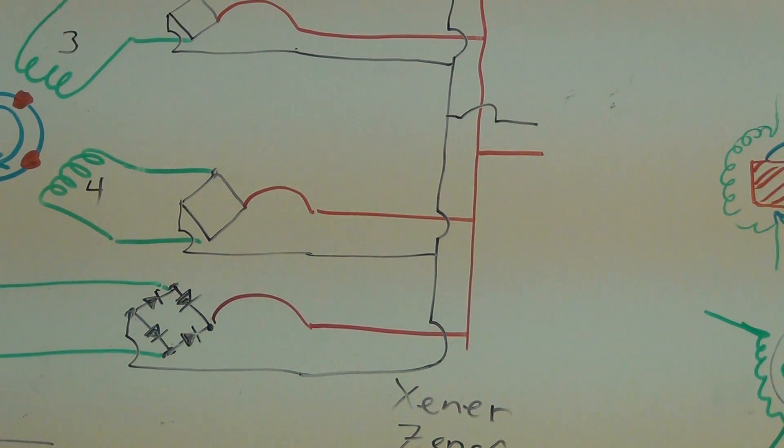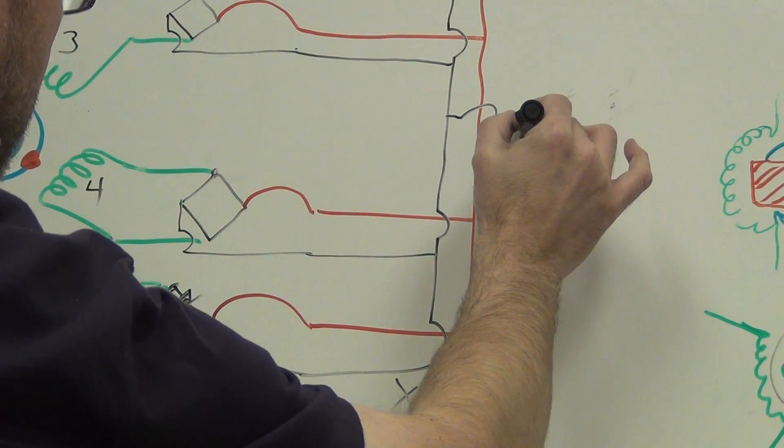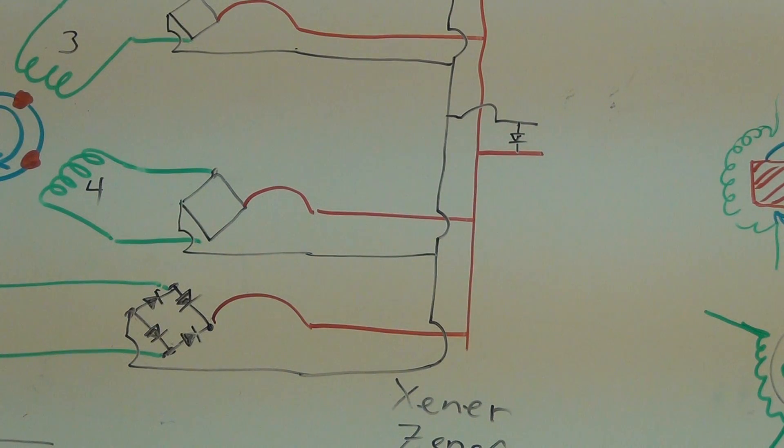What it is, it's a diode. And you put it across here. When the voltage gets too high, it literally just dumps the excess into it so that you won't end up with two or three hundred volts going through a system designed for twelve or something like that. You can get them — ideally you just want one at fifteen volts and you can buy them off the shelf. Anyway, this is getting a lot more technical than I think we wanted to — a lot more theory and wiring. But that's the whole thoughts I'm having and that's the logic I'm using.